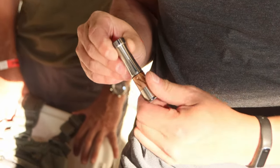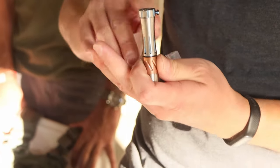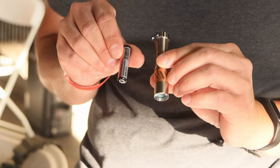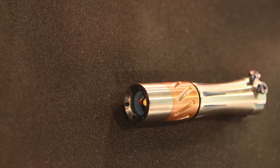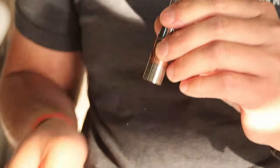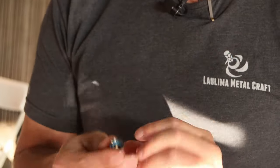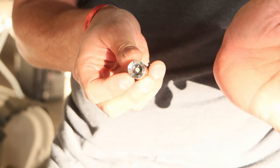Let me show you some of these lights. We make a small one — it has a 10440 battery, so these are sort of a AAA-sized battery but it's a lithium ion, runs 3.7 volts. This size light puts out about 400 lumens, and the particular bezel I have on here is a mule, meaning it has no reflector so the beam is very flat and dispersed.